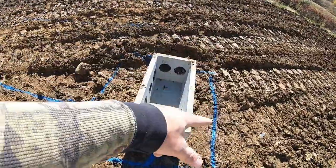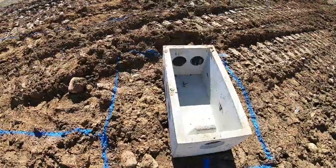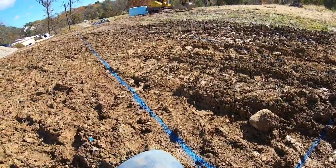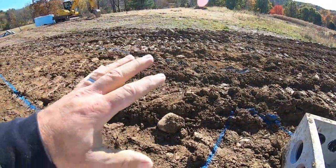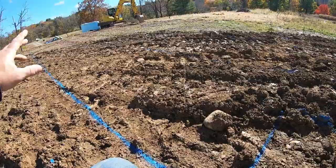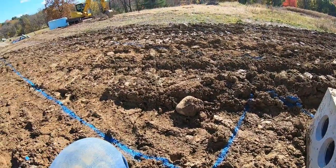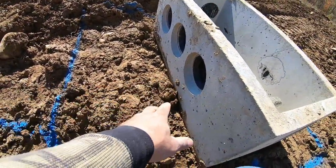So I'm going to over-excavate this. This is called the trunk, when you put this whole trunk going down. Each line, your first box, you want to line up with your line, so all my measurements are right. This will be my first line. Then each line is 6 foot off, and there's six laterals, 50 feet apiece, and they've got a pitch of 1 inch. And the trench gets 18 inches or so of stone, roughly.